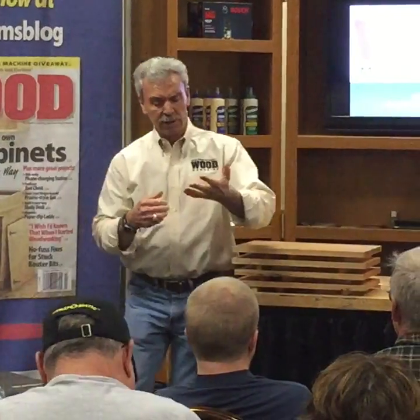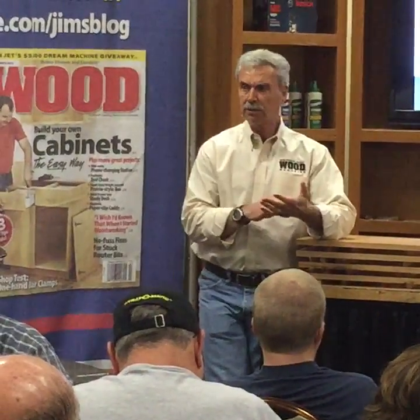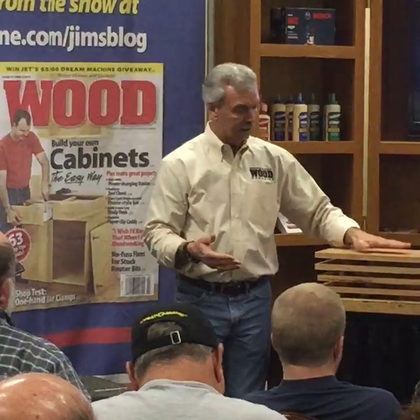The problem is trying to take solid wood and glue it up and keep it flat. I think that's been the issue for a long time. So the technique I want to show you is not an involved one. But what it does is show you how, generally speaking, to take regular wood and glue it up into solid forms that stay as flat as these are.